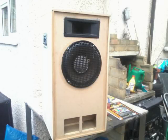Here you see a picture of the finished unit before painting. You can see I've put two side handles in — again you can do this before you fit the drivers in. Don't forget the front main panel where you fit your 12 inch kick bin speaker — you might want to screw that in so if necessary you can remove it for any maintenance you might need to do on the internal sub unit. You can do all the wiring through the back socket panel, so that's easy enough. Make sure all your cables are fed through to the back through your wadding. I've also put a piece of supporting dowling at the bottom of the sub front panel to support it so you don't get any resonance on the panel.